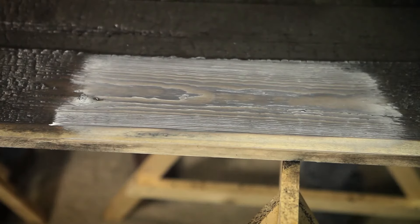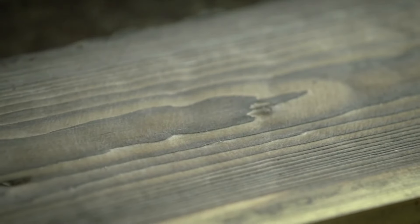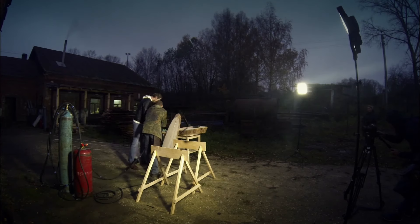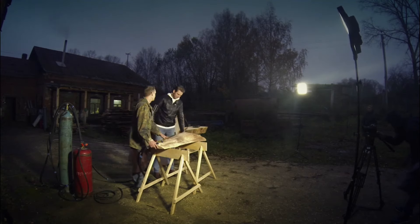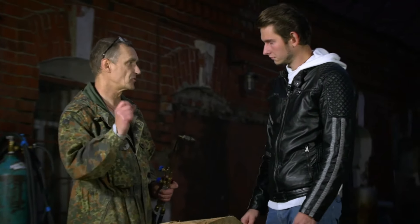It seems that with the help of some usual paint or chemical substances, to obtain a color like that is impossible. We'll now take a slab — a saw cut, the upper part when they saw logs on a power saw bench. These are wastes of production, essentially like firewood. We're burning the wood to display the cracks, blow them through with oxygen to make them more visible — the upper layer burns out and the tar knots remain dimensional. That results in a really interesting decor.